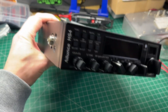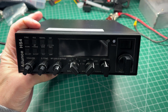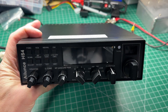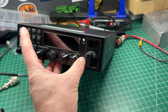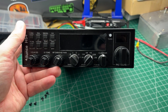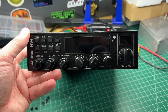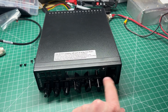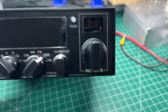These radios are advertised as ham radios, but they're pretty much copying CB radios — they've just added amateur 10-meter (sometimes 12-meter) functionality using a channelized tuning knob. My advice to the companies making these is: do away with the channelized tuning situation. That's fine for CB where channels are fixed, but with Amateur radio we can be operating between those channels, as I showed earlier with those contest stations — and it took quite a bit of effort to tune them in. Put a proper tuning knob in so you can tune up and down the band properly, and I think you'll be on to a winner.